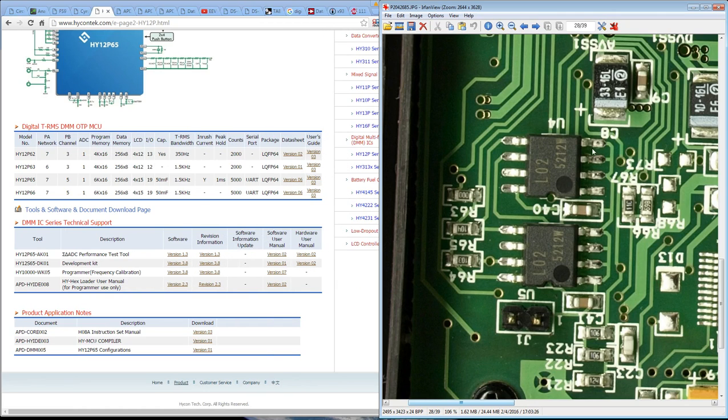So actually, one of those has got to be ground, so probably ground and power here like this, because that's going to a bypass cap. So power pin here, ground over here. So they're going to have 3 addressable pins here, so that'll give you 8 addresses for the I2C. And then you've got your ground over here. These look like your digital address pins, but then you've got to have your I2C pins as well. So they're going to take 2 pins.